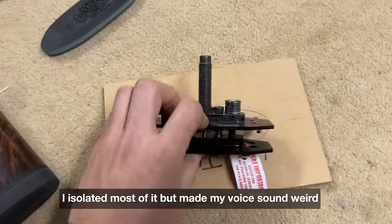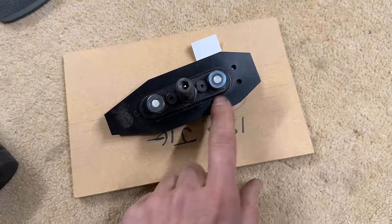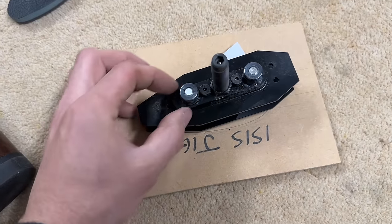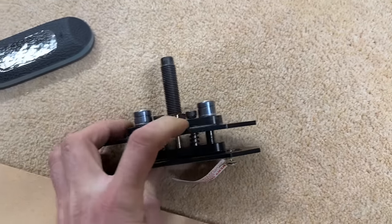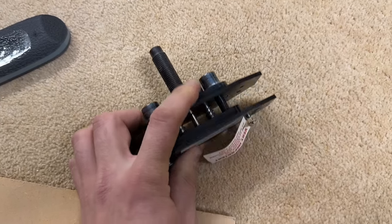The fitting of these jigs, you basically need to router out. That plate sits flat on the end of the gun stock. You need to router out a housing for this outer section here. It needs to be deep enough to allow that recoil system and then rods that poke through it as it works to clear without hitting any timber.